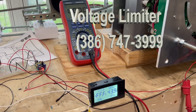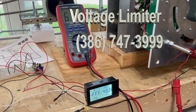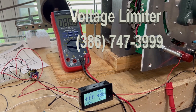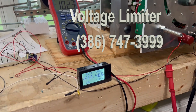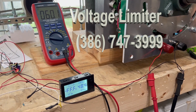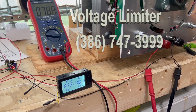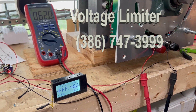I'm going to speed it up. You're seeing I'm at 49. I'm speeding it up faster — now it's at 61, but this is staying at 48. Now I'm at 73. I'm at 85. I'm at almost 100 volts right now, and this is 48 volts. So it doesn't matter what my speed is or what my voltage is, I'm going to get 48 volts. That's the perfect level for a 48-volt inverter. The speed can go up and down all over the place — this thing locks in at 48 volts. This is what you want.